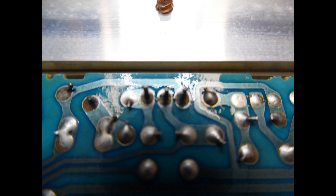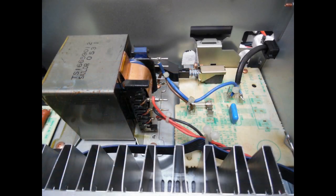On the 30, 40, 50, and 60 series Marantz amplifiers there are always dry solder joints — a very common issue around the voltage driver transistor mounted on the heat sink. The video zooms in to show solder cracks around there, so always reflow those. This can cause an amplifier to go into protection mode or blow the power fuse. I found dry joints around the driver transistor, and also found that the input protection fuse had been replaced with a 1-amp fast-blow fuse — which is wrong. That fuse should be a time-delay T-type fuse rated at 1.6 amps, so that was correctly refitted.